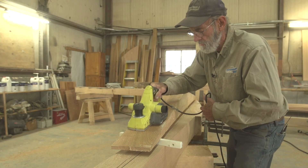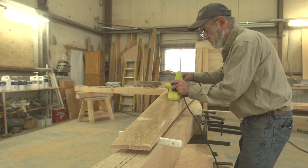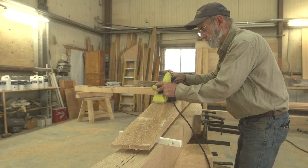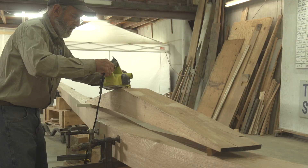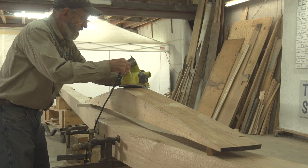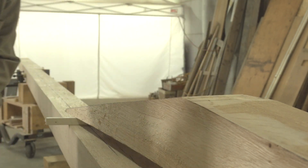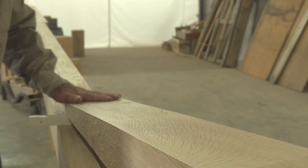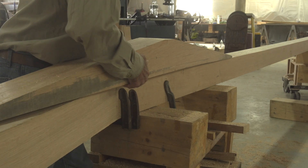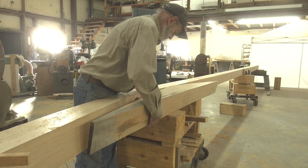You'll notice that all the time I'm working on this, I've got it at the right height for myself. I don't really feature crawling around on the floor doing this kind of stuff — I don't have to lean over, I'm standing up for every bit of it. That's the planing, the fitting — it's actually going to be up there when I drill it and join it together, and then eventually we'll stand it up. I've made all the bumps go away, I've got a couple of saw marks left but I'm going to leave that alone. I can feel it for lumps. That side's done — let's bring it over into position and clamp it up and see how it fits.